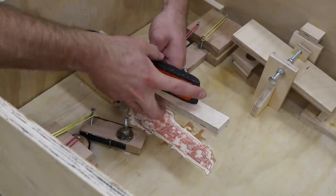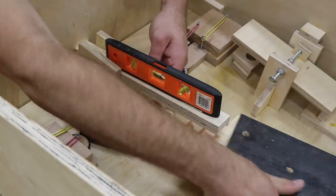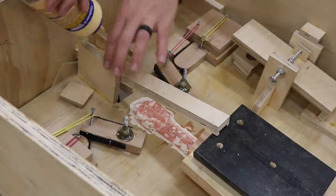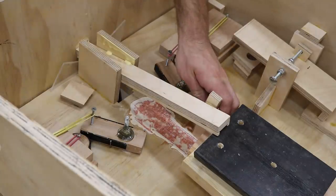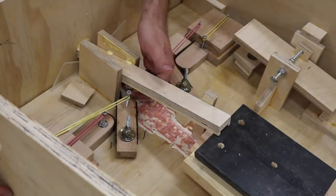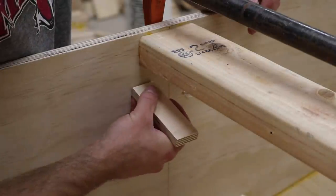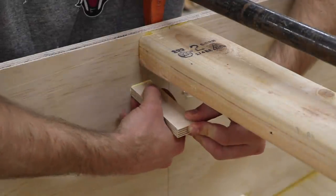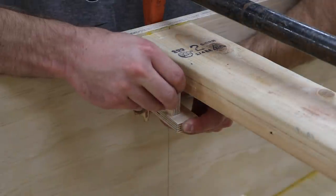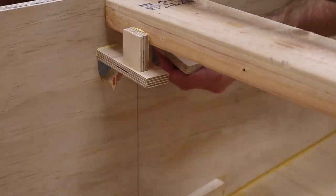Working with the machine upside down is a bit confusing because I have to work in reverse. Instead of building a ramp that goes down, I have to build it going up. I used a level to make sure I had enough slope for this first piece after the pinball drops. I repeated this same process for the entry to the other side. Next, I skipped to the end and installed the small ramps that lead to the exits. One ramp is longer than the other because of the crisscross. I supported them with connections to the 2x4.